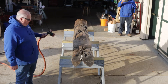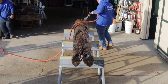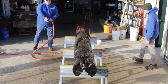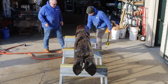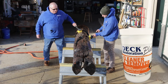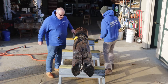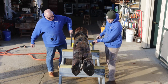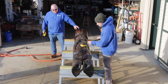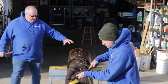So the first thing we're going to do is pre-wet all the wood before we put anything on it to restore it. When we do something like this, it doesn't always need a pressure washer. There's plenty of ways to skin a cat. You can do anything with a pressure washer or equipment, but you can also do it by hand with a garden hose if you had to — that's what wood restoration is. You can already see the nice color of the wood coming back, with a nice cedar or orangish-brown tone compared to where it was dark.